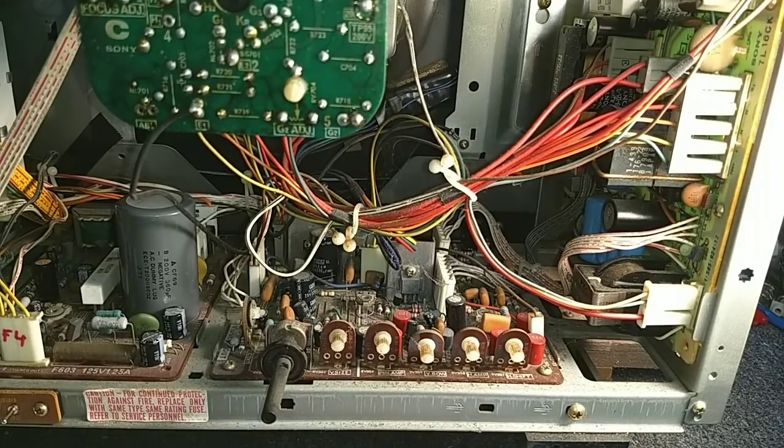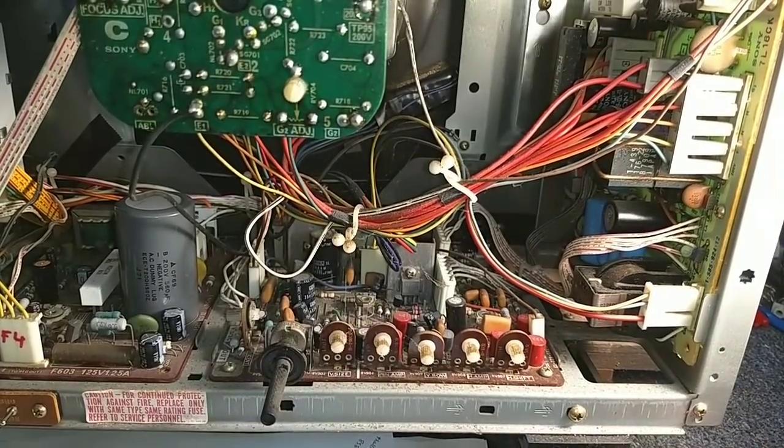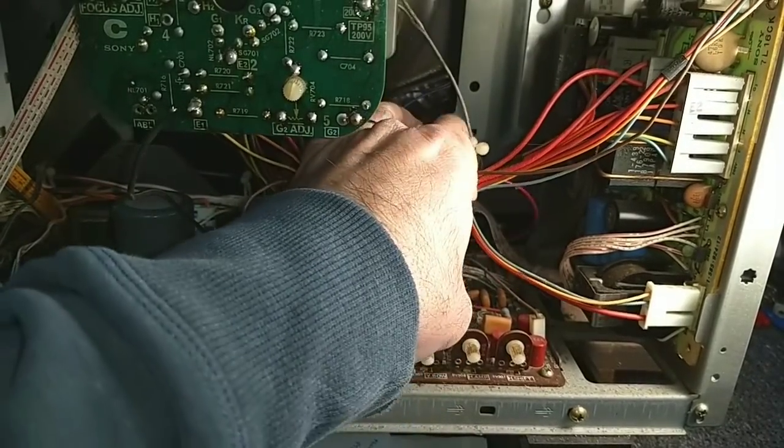And so we've got small connector there. And then we've got our yoke back here. Another one next to it, which is a 2-pinner. And then another colored one in the middle of the board. And these two deflection connectors over here that go to the drive. So there's my primitive map there. And I'm just going to number them as I take them out. Any ones that have numbers, it's obviously going to be beneficial.